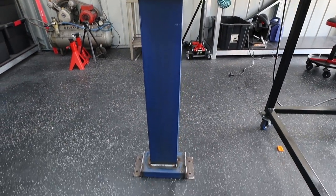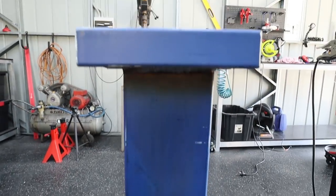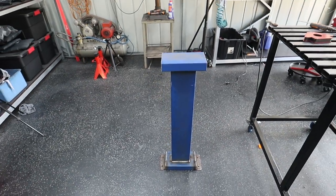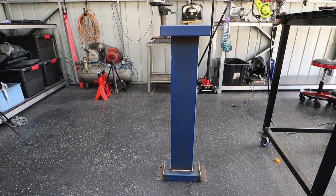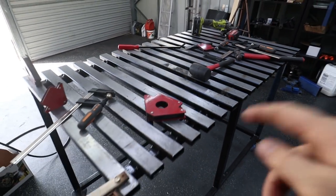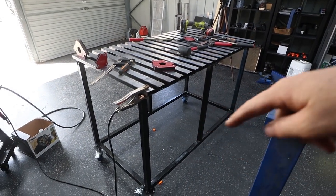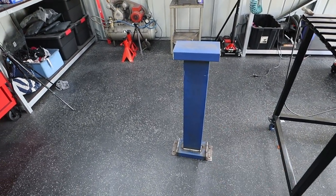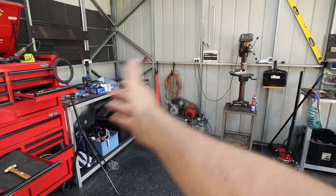That is a stand for a bench grinder - done. I cut two bits at 250mm, added some angle iron on the side, drilled two holes so I can dynabolt it to the ground, and the bench grinder sits perfectly on top. As for the welding table - I have no idea why I didn't own one of these earlier. That is honestly the first time I've ever welded on a table - I've always had to do it on the floor or make something janky. The table came in bloody clutch. I was clamping stuff down, doing full welds all around, walking right around it easily. Basically, if you've got a shed and you like welding, build a welding table - $400 and you can have your own. Now I need to clean out this corner and figure out the layout.